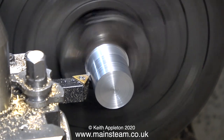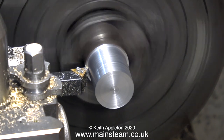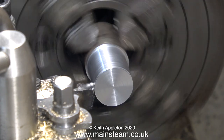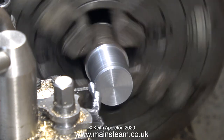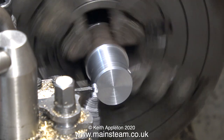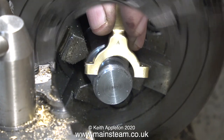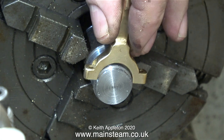As I mentioned, this is a hard piece of steel — not the free-cutting stuff — so it should be hard wearing. I've changed the lathe tool for a parting tool to cut this to shape, leaving a bit sticking up in the middle. The bit sticking up in the middle of the eccentric sheave holds the eccentric strap in the correct position. In this clip I'm trying one of the eccentric straps in place to make sure it fits, and thankfully it does — it fits on both of the eccentric blanks.